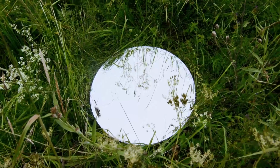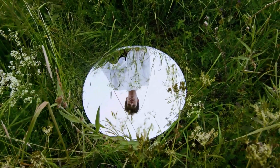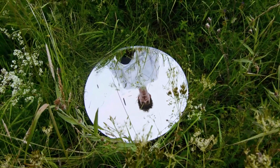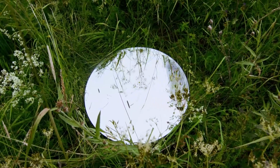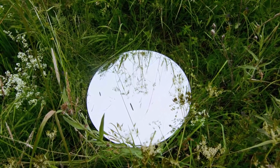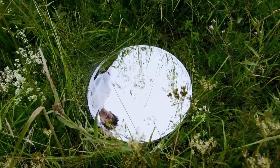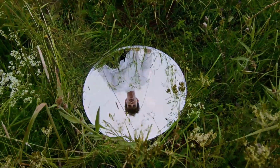With the septic tank securely in place, it's time to backfill the hole with gravel and sand. This will provide support and stability to the tank. Ensure that the backfill is placed evenly around the tank, and use a compactor to tightly pack the material. This will prevent any future settling or damage to the tank.